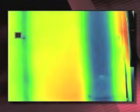On the narrow 5-inch cavity, we just plain didn't insulate it. As expected, we see a big difference — in fact, with this example you can even see it clearly from the outside of the house.